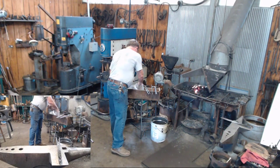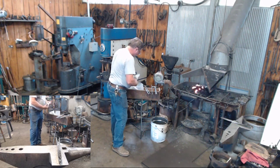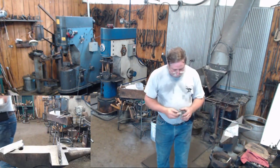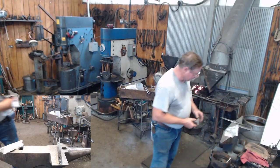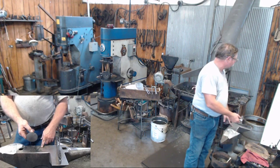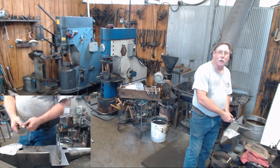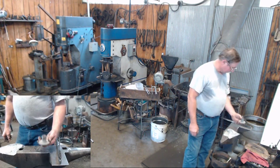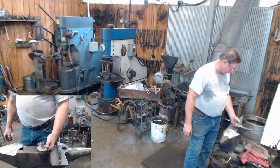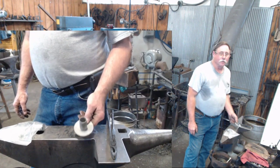Okay, our candle pan, or our candle assembly. Three-inch diameter circle. I think I've got 16-gauge written down there. That's not carved in stone. That's just the material that I had around. When Travis and I did this project for Athens State, another thing that I had laying around was some 1-inch tube, and that's what we used for these two pieces.